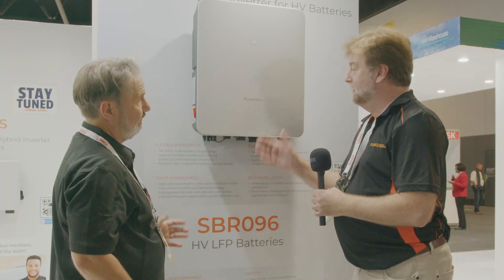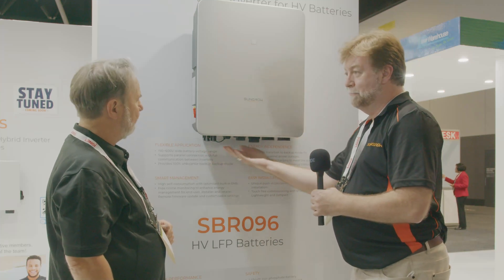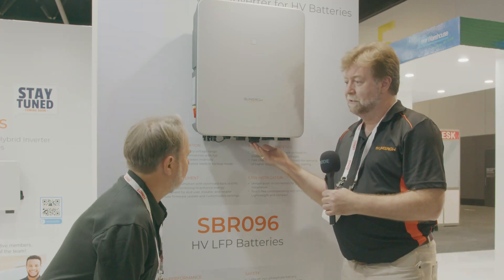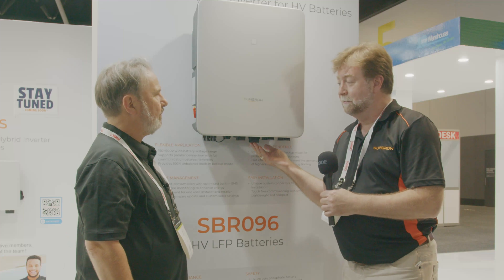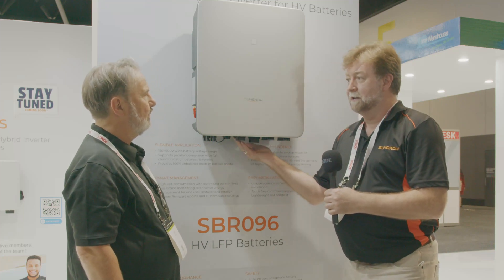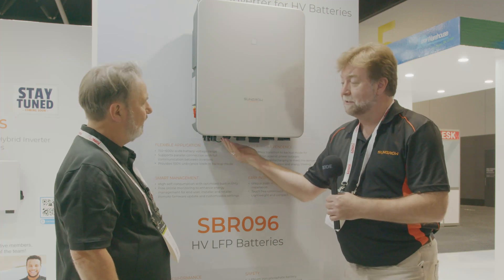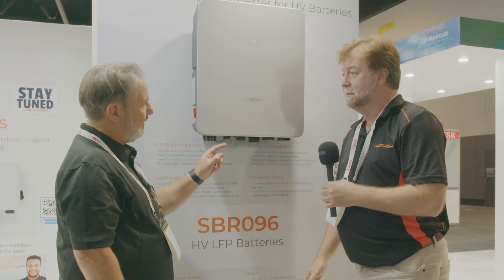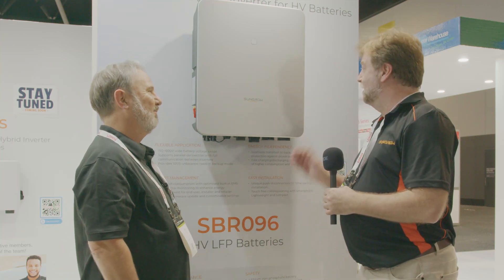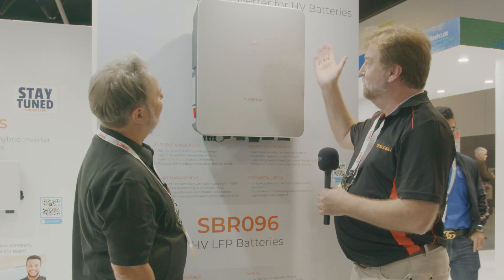This is all you'll see on the wall — and the beauty of this new one is you don't need to take the cover off, everything's plug and play in the bottom. You've got the grid, the backup circuits with a 20 millisecond changeover, data connections via dongle or ethernet, the PV trackers with MC4 connections, and SunClick connectors for the batteries. The backup is built in.